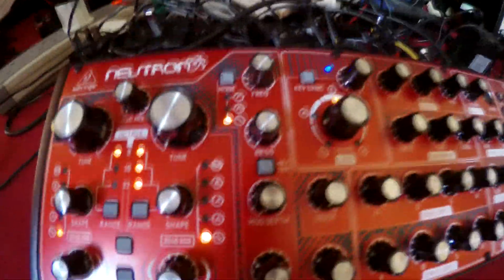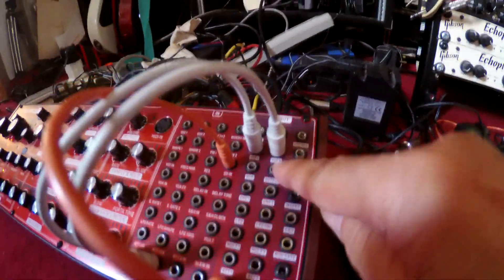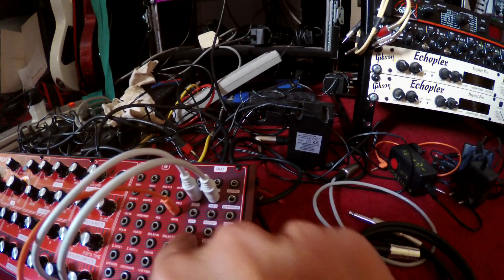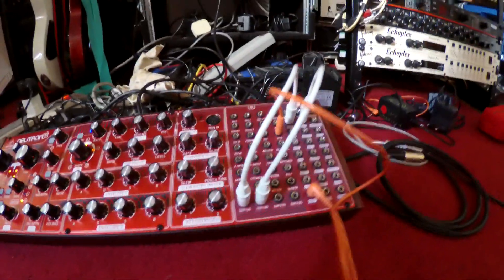The filter here was set as low pass, which means out here I've got a high pass. So we've got the low pass — that's VCF1 and VCF2 — put them into the sum, mixing them together, producing a notch filter.